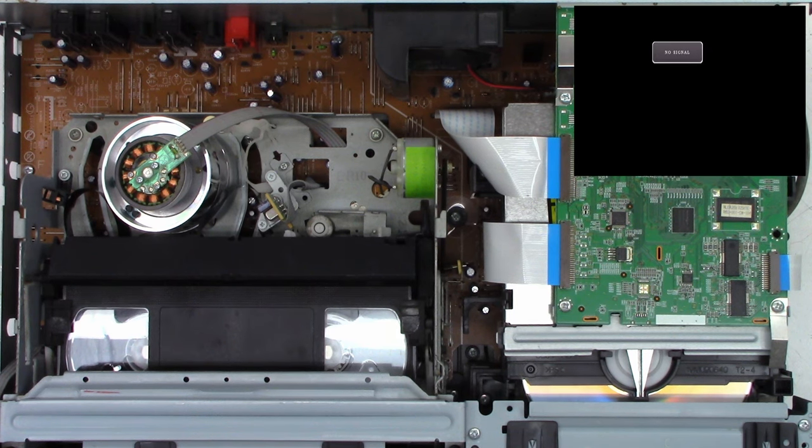Make sure you have written down the positive and negatives based on the capacitor and not the silk screening. I've been burned by that too many times. All right, looks good. We'll trim the leads.